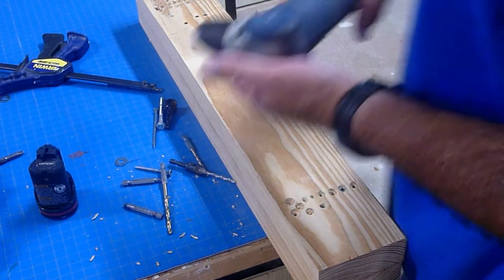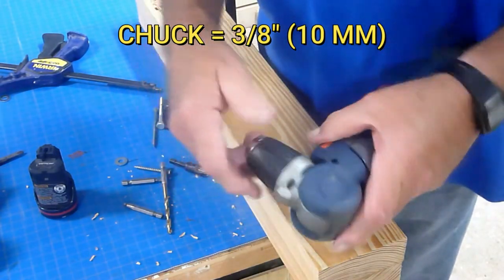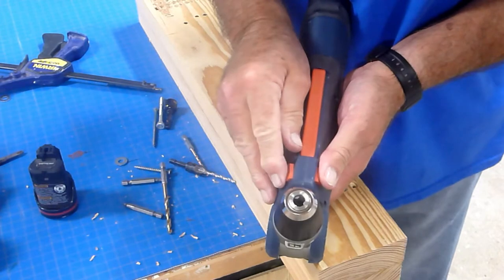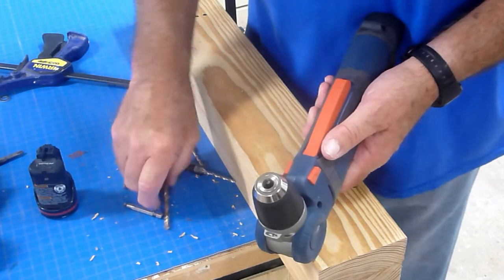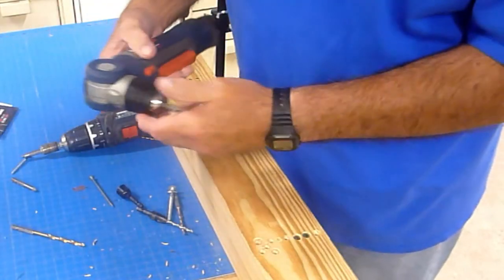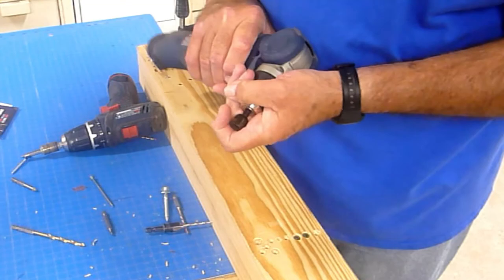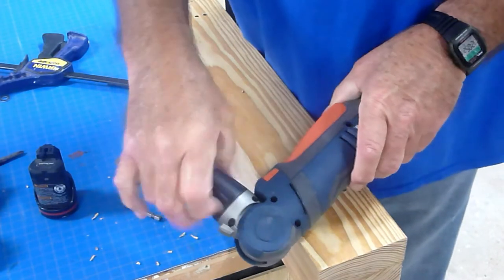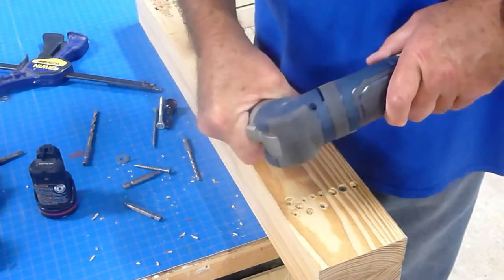Let's talk about the drill, its features, and capabilities. It has a 3/8 inch keyless chuck and a three-position reversing switch, with the middle position being off, which also locks the chuck. This facilitates the proper and safe way to change your bits — with the chuck locked you can loosen with a twist, change your bit, and re-tighten. Even if you power the chuck open in the real world, lock the chuck when finished and give it an extra twist, because chucks tend to loosen during use and the bit can fall out.